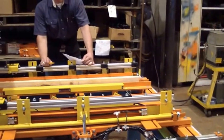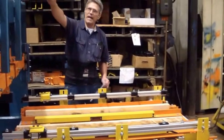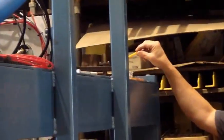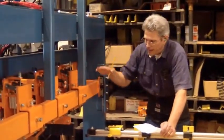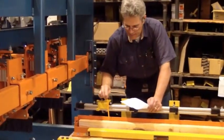The only height adjustment for the bottom board station is that handle right there. These screws. That's only adjusted for the bottom board station. These 2 lock nuts get loosened. The 2 on that side get loosened. Handle, you turn it until everything set at the bottommost position is flush with the very top of this section.